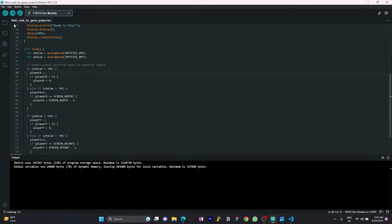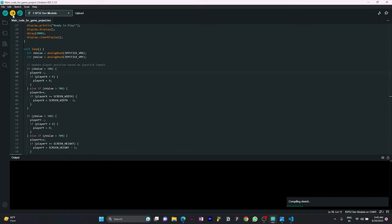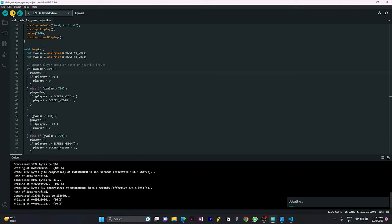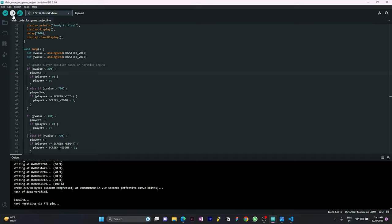Let's upload the code. While uploading, first our code will compile, then go to uploading. While uploading the code, make sure you press the boot button on your ESP32. So I pressed the boot button on my ESP32, and the code is uploading, as you can see. As you can see, the code is uploaded. Let's move to the live demonstration of the project.